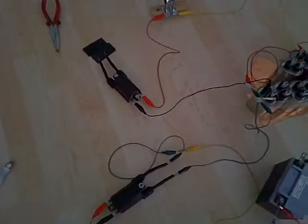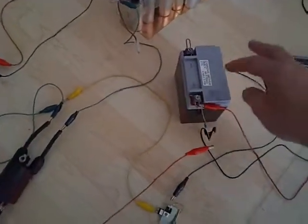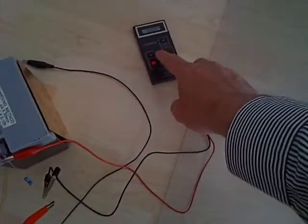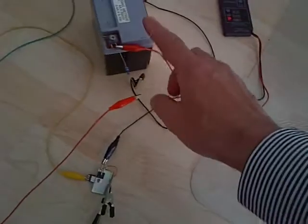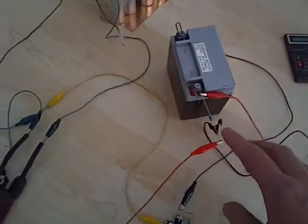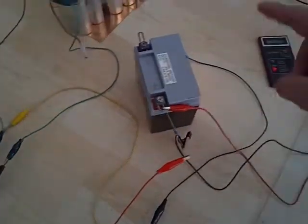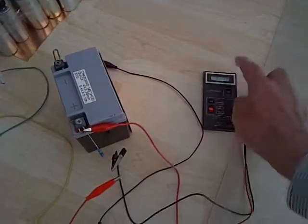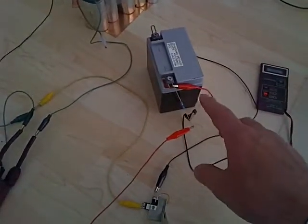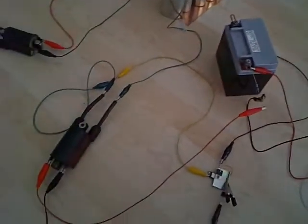Let's have a look at my setup. Here's one battery — a standard 12 volt battery. I've got hooked up a voltmeter. It will be blinking because of the high voltage, but just look past that. There's a 1 ohm resistor over here, so the meter will be showing millivolts — it's in the millivolt range automatically. And it will show the milliamps it is drawing, and of course the millivolts we are losing, but it's not much.